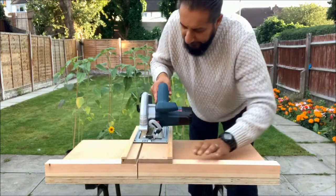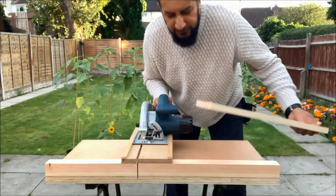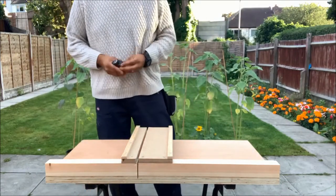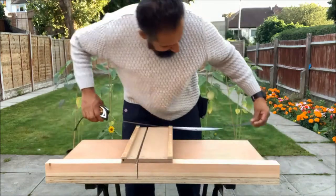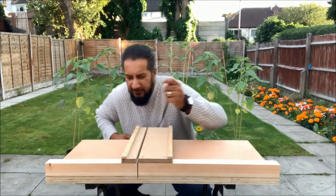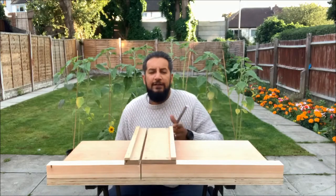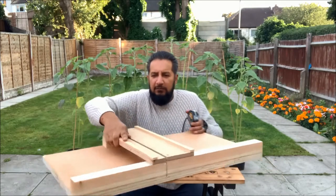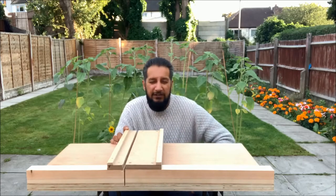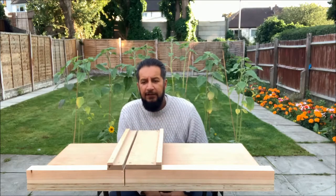The idea being — it's not plugged in — you get your circular saw, you put it in, and you can just run repeat straight cuts. Now let's have a look at how big I've made it. It's 32 inches in length and 18 inches wide. The base itself is made from one-inch-thick plywood, and the supports — the height here — are made from two-by-two, though it's slightly under as it always is. I've used 15mm MDF for the track itself.